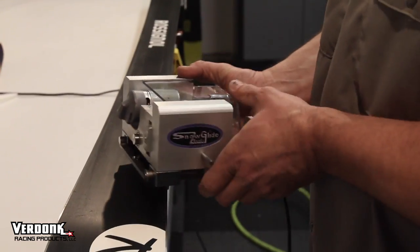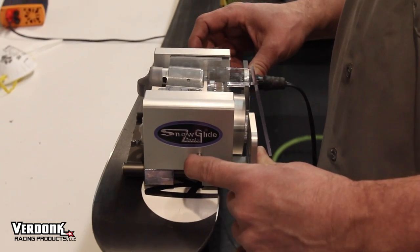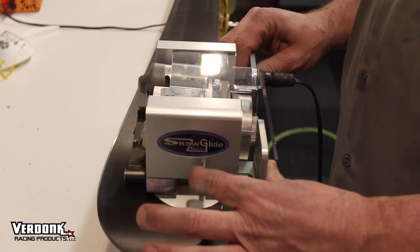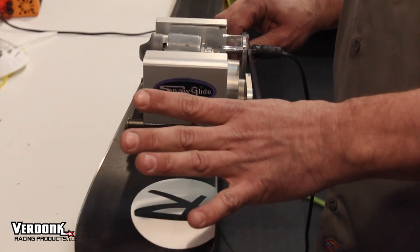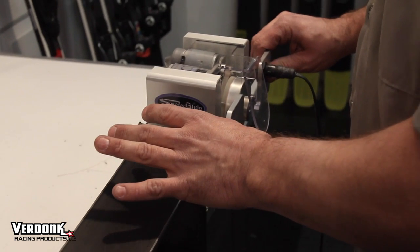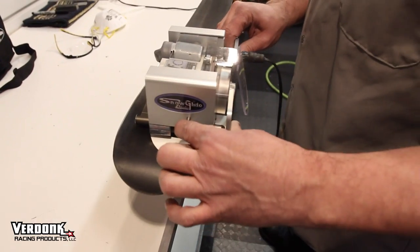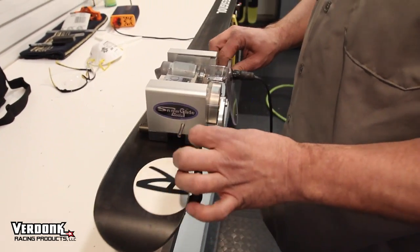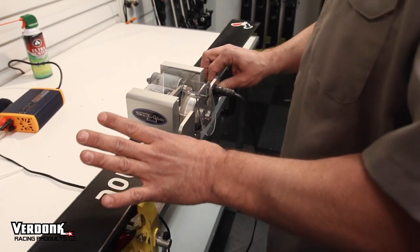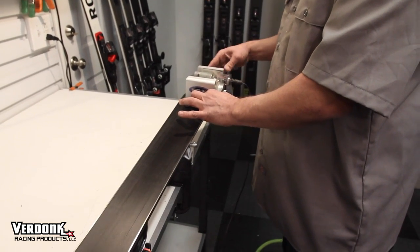The power button is on this side. Push the lower tray against the edge, pull back the clutch on your upper tray — now you're disengaged. Fire up the machine with the power button, position yourself where you want, then let the stone come in. As soon as you hear it grind, run it from tip to tail. Your cadence is about eight to ten seconds per edge from tip to tail. Disengage at the end and come back to start over again at the tip. As you grind, make sure you're only holding the lower tray — let the upper tray be pulled in by its spring pressure only. When you get to the end, disengage and shut the machine off.